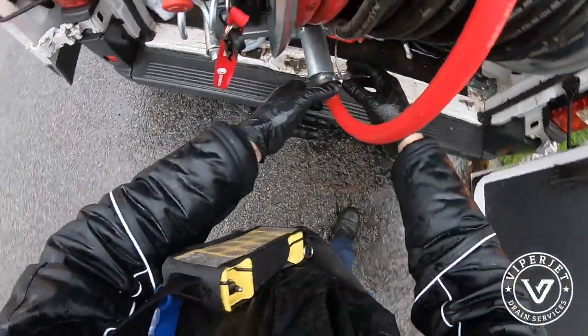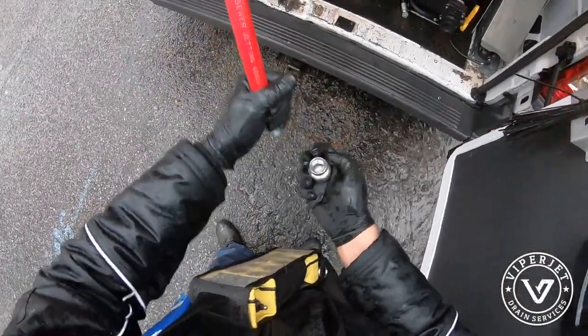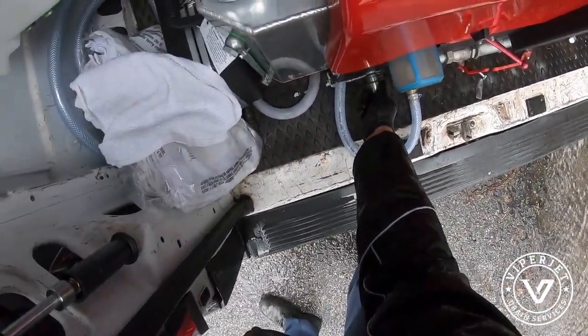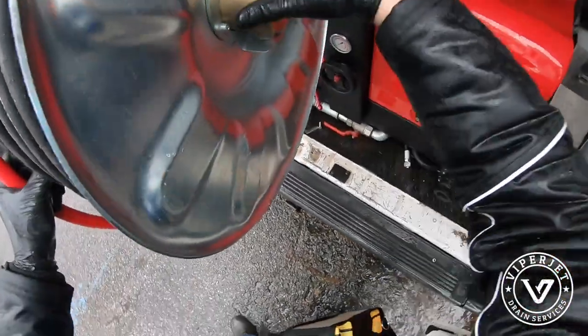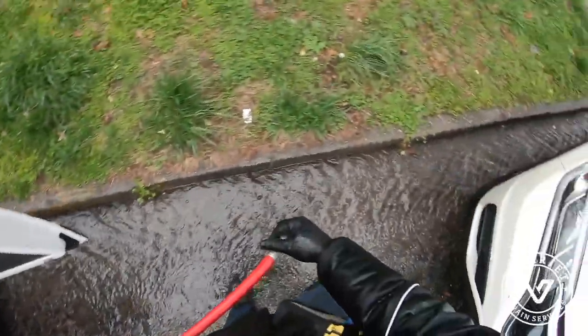They say the machine doesn't like to idle, because he has a heat exchanger, that's how he cools the motor. So we're gonna keep it off so we're all set. I'm not gonna use the hydraulics.